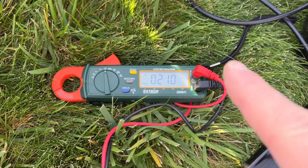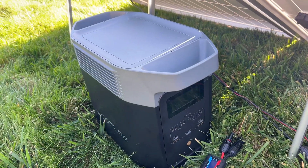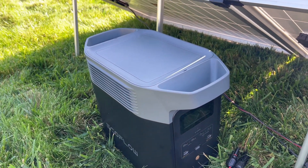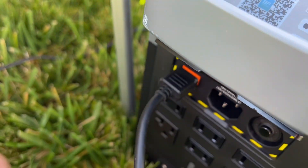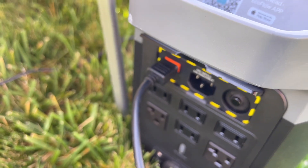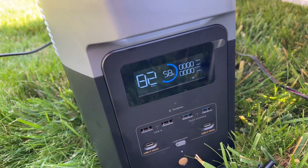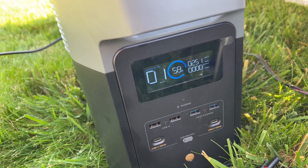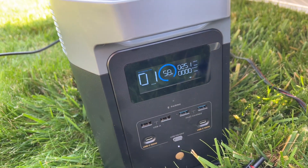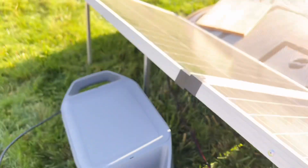Because the voltage is only 20 volts I can hook this up to other types of power stations. This one is rated from 12 to 60 volts, so now I can plug into it and charge other types of power stations or use other solar controllers without going over and frying things. Charge controllers don't like being over-voltage — that'll fry the controller inside. We're up to about 250 watts using this configuration.